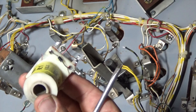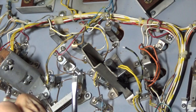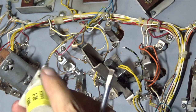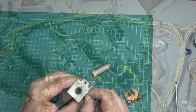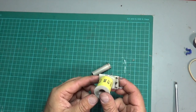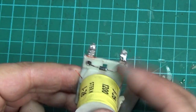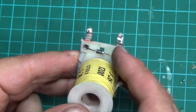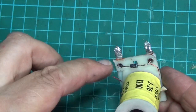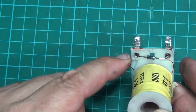potentially looks like it's loose, that goes from the actual solenoid onto the lug. Seems to be loose, but let's go and have a look and make sure. Okay, so what you can see here, if I zoom right in, this is your standard sort of older machine solenoid setup, where you've got your banded diode on the solenoid.